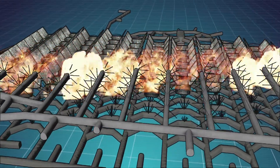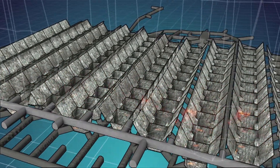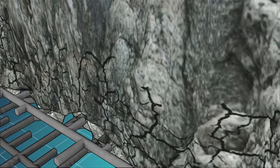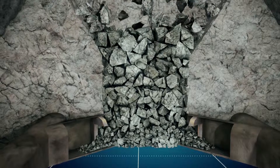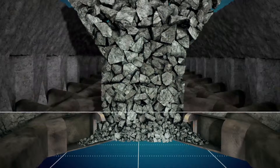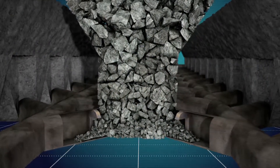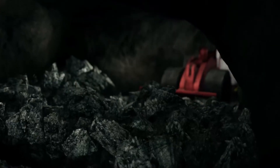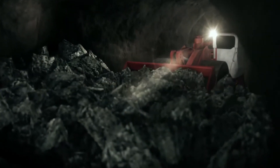This process breaks a layer of rock across the bottom of the block of ore and leaves a large unsupported area which starts fracturing and caving under its own weight. The ore body starts to cave once the undercut is complete and ore is removed from the drawbells, creating a void. Once development is complete and the ore body has been undercut, the mining process is relatively simple, with continual fracturing and breaking of rocks to smaller pieces for extraction without any further blasting.